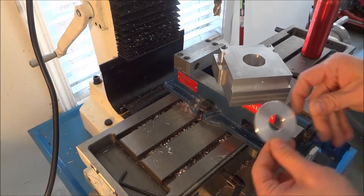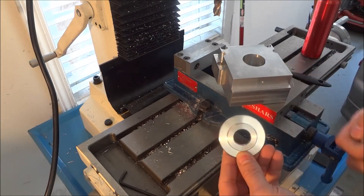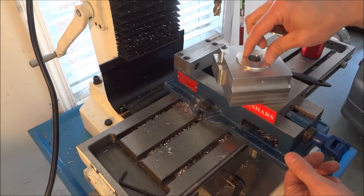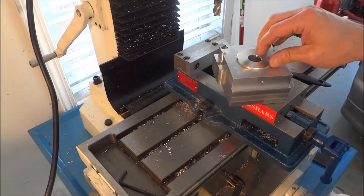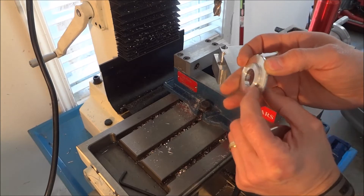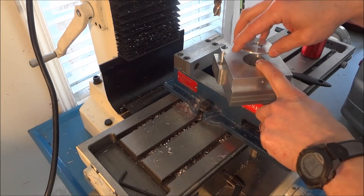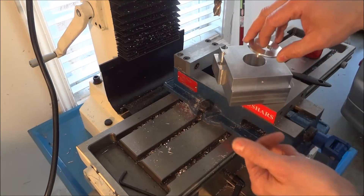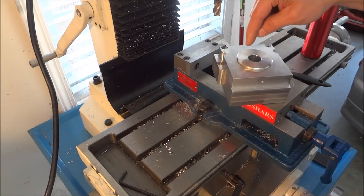So now I have my bearing covers made and they'll just fit in there like that - they're snug but they drop right in. You really want just this area here to press down on your two bearings. Remember, you're going to have the spacer in the center. Now we need to mark it to drill our four holes.